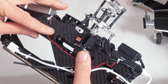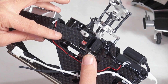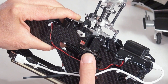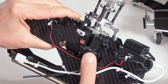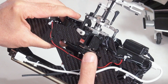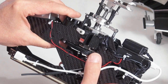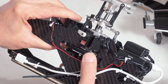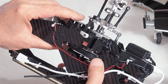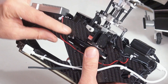These two marks are the original holes, and just by looking at this you can see where they landed up. What you're looking for is: hold the motor on top and on the tooth of the pinion, you want a small little space between the gear and the pinion. Rotate it a few times because at some point there'll be the tightest spot, and that's where you want to adjust it. You don't want to adjust it on the loosest spot — you want to find the tightest spot. Find it where it's the absolute tightest, where you have no movement, and that's when you adjust it at that point.